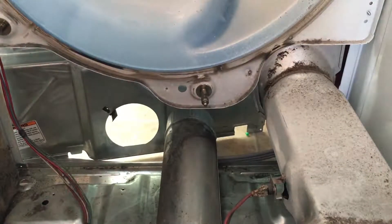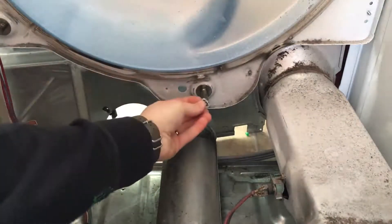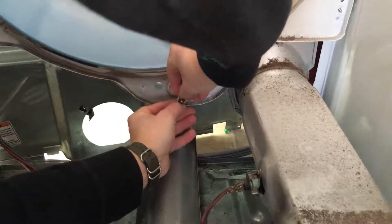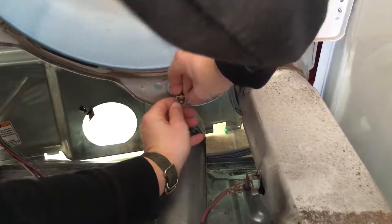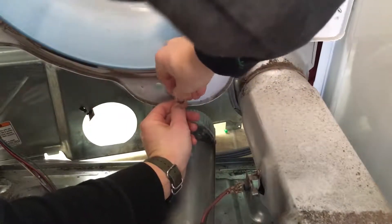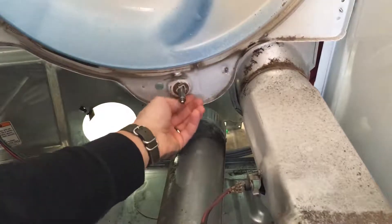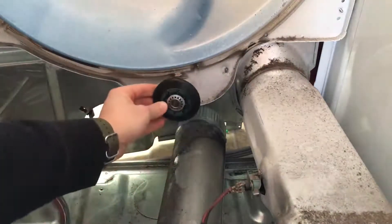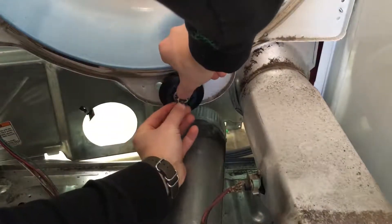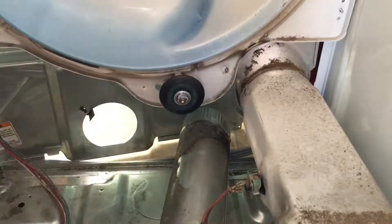All this is going in the trash because I have brand new tri-rings and a brand new roller. You want to wipe off the shaft and make sure it's nice and clean. Put a new tri-ring on there — kind of tight quarters. These are tight fitting and that's good because you don't want them to move, but it also means it can be tough to get them slid on there. There we go, that's on.